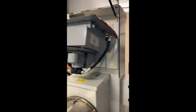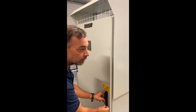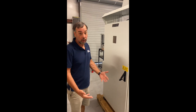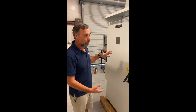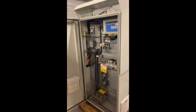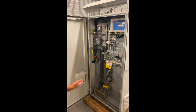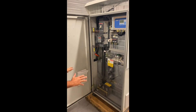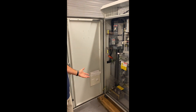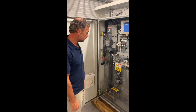If we come over here to the control cabinet door, we need a key to open it. With the SmartCraft, and all SMPS units, the control is with the transformer on the roof. With Kraft PowerCon's SmartCraft, we have a similar control cabinet with the components easily laid out so it's easy to work on. Typically when you're working on this it's on the roof, and many times you'll have a weather enclosure on your precipitator.